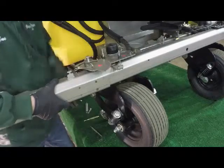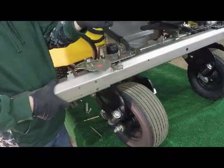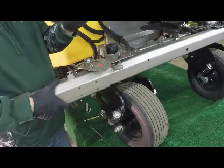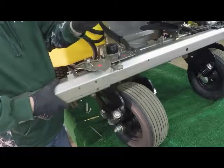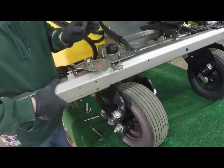And then we also have to make sure we put a washer. This is very important, a flat washer, like it came from LT Rich, in between the boom arm sections. That keeps it from binding, and it also helps prevent damage to our bubble guide underneath when we tighten things down. I'll go ahead and tighten this up, and then I'll start the video again.